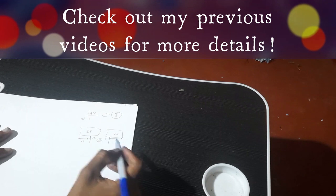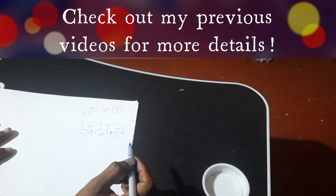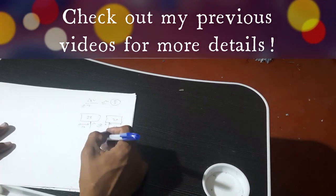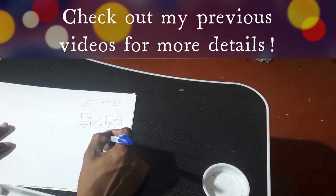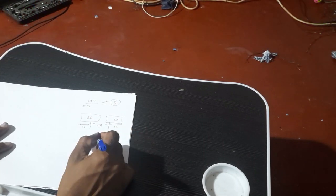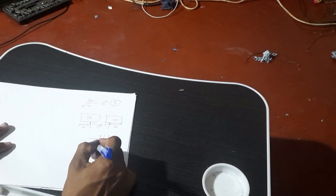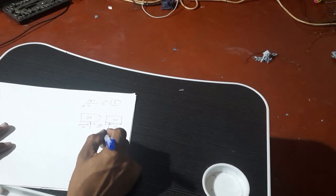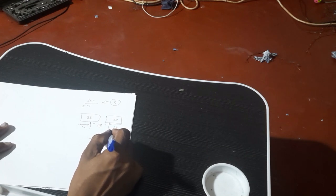I have battery packs of 28 cells and 20 cells. Therefore, to make 3 groups in series, I will divide them into lots of 16 each. Here, I will connect 16 modules in parallel and join 3 such sets in series to give me a battery pack of 24 volts, having used 48 battery modules in it.